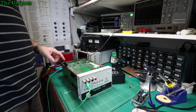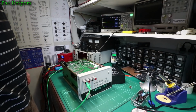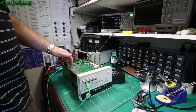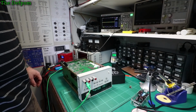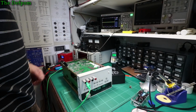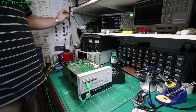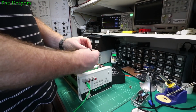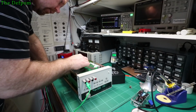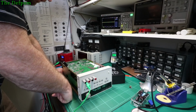So it's not the supply, so the IC is definitely bad. So at least I've eliminated that. So yeah, I have to wait for those LM2925s to turn up then and drop those in and see if that solves the problem. But at least we did find another problem at the same time, which is always a good thing. So yeah, don't trust the diagrams. I mean, obviously this part is under spec, but it didn't look like it had been resoldered. Like these other parts over here, they also look like they've never been touched. Although that C158 did have a bit of noise on it. But yeah.